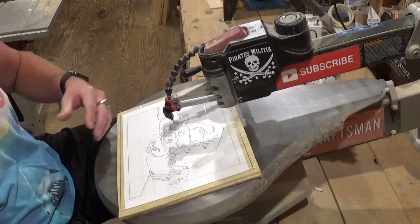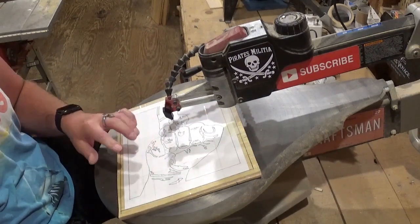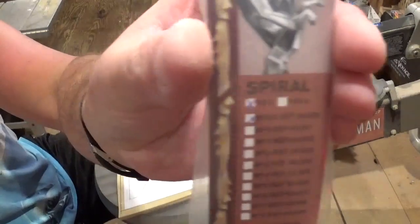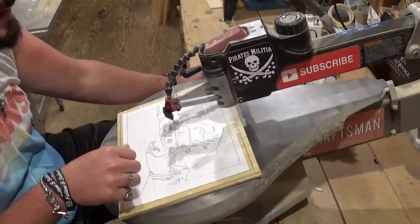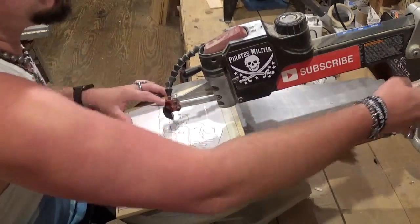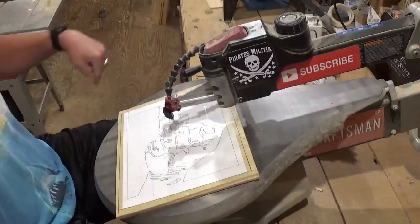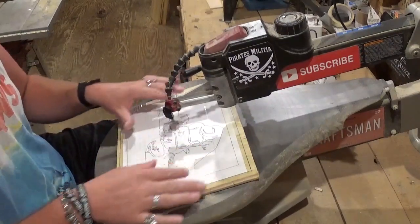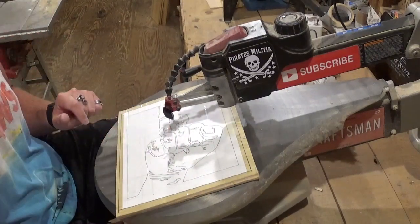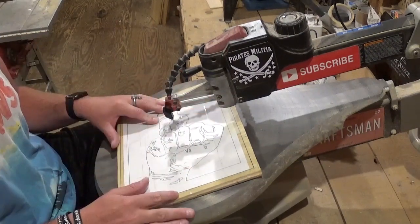The spiral blade is a slower and more tedious cut for me, and that's probably just my lack of experience. I know there are dedicated spiral blade users in the scroll saw community who could tell you about these blades much better. These Pegas number two spiral blades are a twisted blade that gives you limitless throat depth — you can move a piece two foot by three foot and cut in a 360-degree direction. I'll do one pilot cut here in real time, then put on my dust mask and ear protection and proceed to the time-lapse.